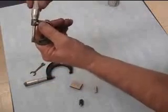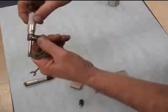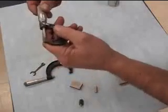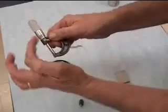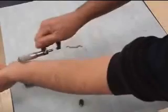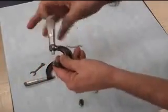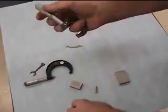When I'm at zero — this one doesn't have the ratchet stop, so we just want to put a little pressure on it. It's not a C-clamp, it's not a crescent wrench, it's not a vice grip. Take it very easy — it is a precision measurement instrument. I can use my palm or my forearm to spin it open rapidly. What we don't do is twirl. Don't ever twirl a mic — it's not good for the threads and you will ruin it. These things are very expensive, so we don't want to tear them up.